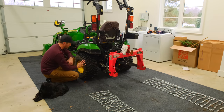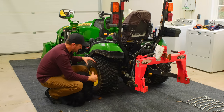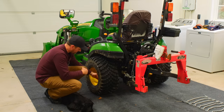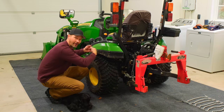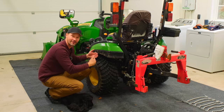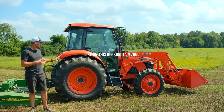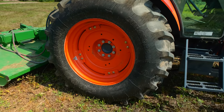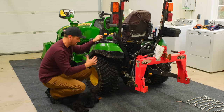A lot of tractor wheels as well, it may or may not give you enough space, but the wheels are actually going to be reversible. And so the other thing you can do is a lot of wheels are gonna have the center plate that's in here actually offset. It's not completely right in the middle of the wheel, left to right this way. It's actually offset or off-centered a little bit, so you can have a narrow and a wide position. With the larger tractors or some of the older tractors, the center plate is actually bolted in, and you can configure that in like 8 different patterns and get really wide or really narrow, all sorts of things. So there should be information in your manual about how to do that. It's an option for a lot of machines.